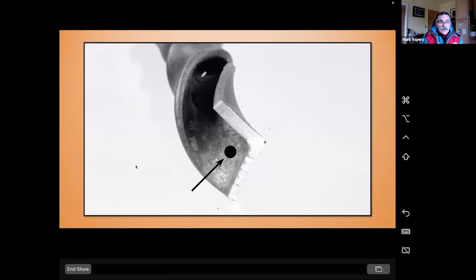So you've twisted it, and me, for the right-handed person, I twisted it counterclockwise. I am now just going to cut it from the bit that you're holding in the vise, leaving me with about 1/2 an inch of stock.